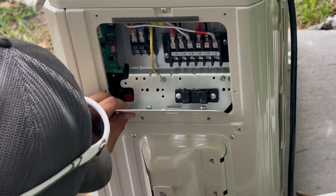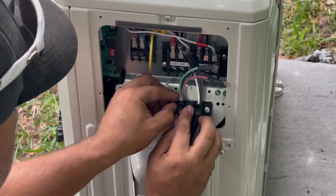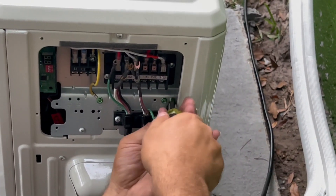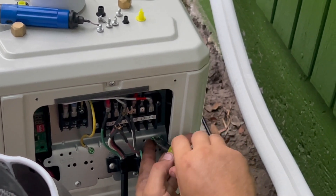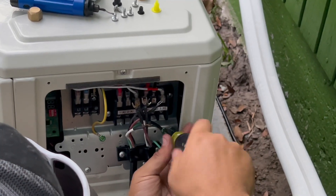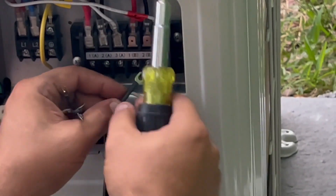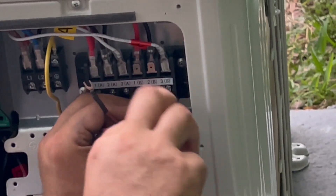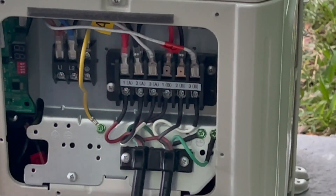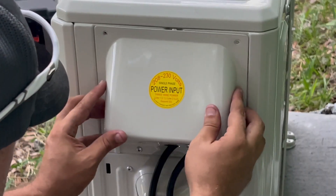We'll go over here and then over there. Before performing any electrical or wiring work, turn off the main power to the system. The cable I got came with pre-installed lugs from the factory. Attach three leads of the signal wire to terminals one through three of the terminal block, and the ground wire to the ground lug on the metal panel to ensure a tight connection. Don't forget to fasten the cable to the unit using the cable clamp, then replace the wire cover on the side of the unit and screw it into place.